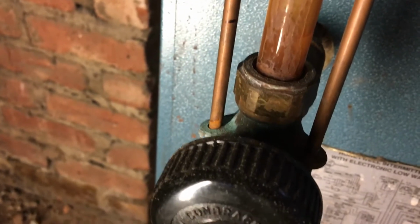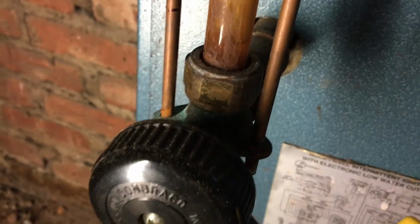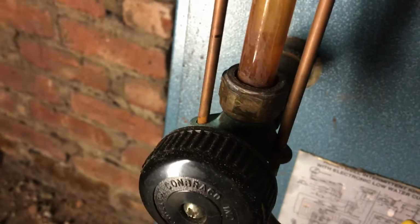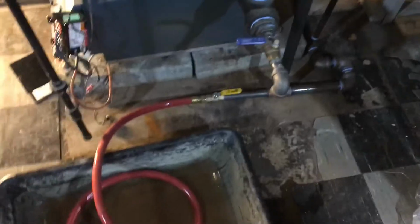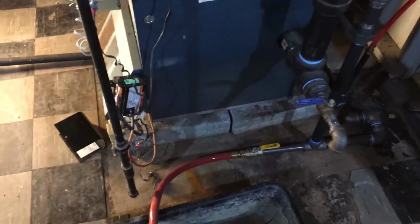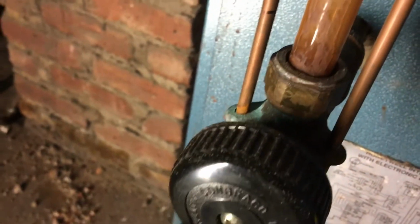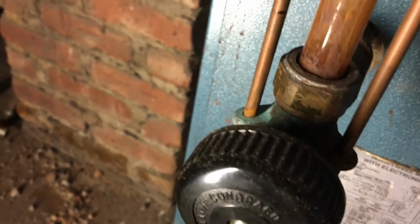And the water is dropping down. I've got maybe 2 inches until I get to the bottom of this pipe here, and I don't really want to have it dry firing. It could cause a fire, or it could crack my boiler, which I'm taking out of service anyway. But I don't really want that. The temperature of that firing chamber area is going to rise dramatically when the water is gone, and I don't want that. So I'm going to shut this experiment down. I can see the water level just in the glass now.